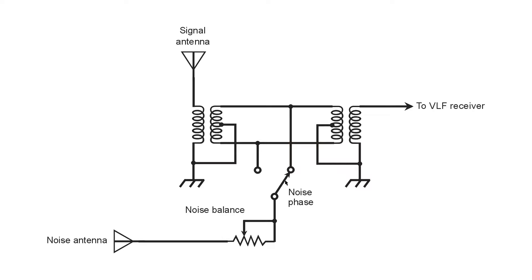There were only two switch positions. To my amazement, I discovered a deep null in the noise at a particular setting of 20 to 30 dB, which made it possible to hear a lot of signals I could not otherwise hear. The lowest one I heard was at about 13 kHz — a signal that resembled something similar to what we call WSJT mode today, and very probably was some kind of synchronous mode.